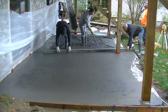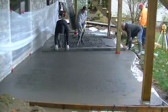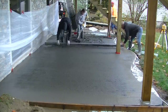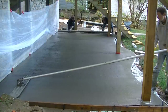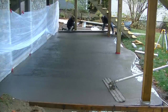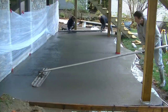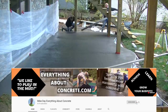You can see Darren and Luca getting the concrete screeded and leveled. This patio slab slopes away from the building about an inch and a half. It's about 11 to 12 feet wide and about 30 feet long total, so we've got a little bit of slope on it. The guys are finishing up screeding it and I'm bull floating it.